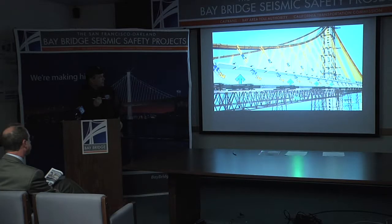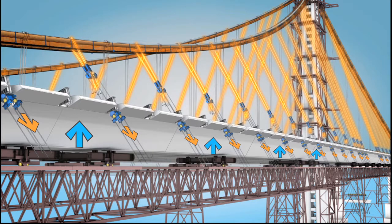Basically what we're doing is this temporary work — we had to build two bridges in order to get this bridge placed. The decks were set on top of that, on top of these cradles here. And then what we're doing is we're transferring the load onto the suspension system, which you see here. In order to do that, the jacks are going to be pulling down on this cable.